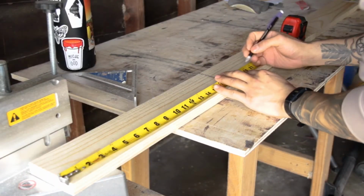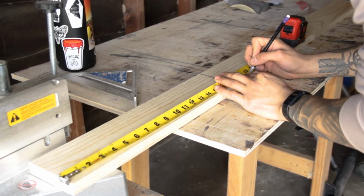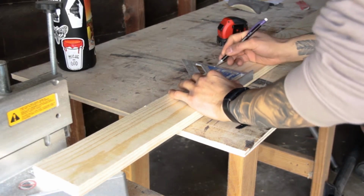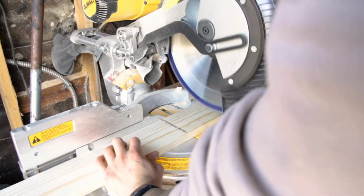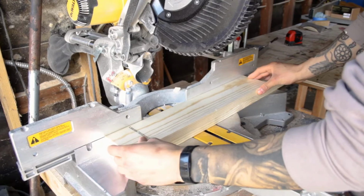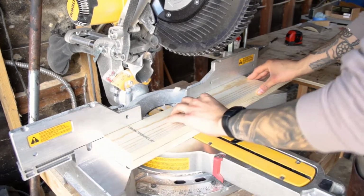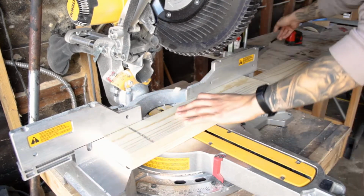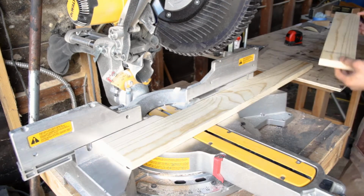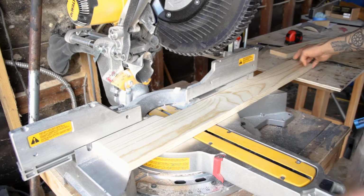Alright guys, first thing we need to do is measure out the base and the rack itself. These are going to be 19.5 inches for both, and I'm using 1x4s. For our second cut, I'm just going to take the first piece and trace it instead of measuring twice. This helps everything be more consistent, especially if you're doing more cuts, but this time we're only cutting 2 pieces.